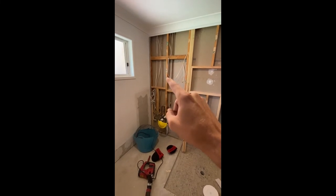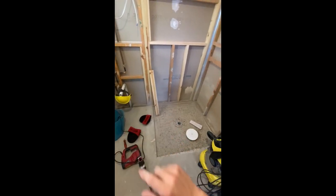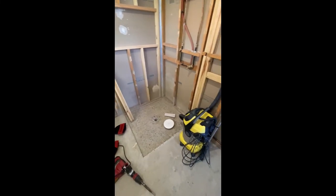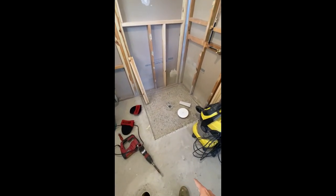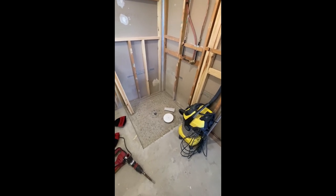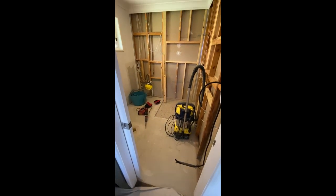There's going to be a mirror with LEDs in it so there's a cable there. We're going to waterproof the whole area and up the walls — probably around two to three hundred millimetres. That's sort of it, guys — I'll hopefully have more structured videos and progress videos going forward. This one is just to get it stripped down with the rough-ins done, and then I'll show you the build process. A lot of people tile over tiles but I'd rather strip it back and start from scratch — more work but a better result, and that way you can get rid of that step/lip for a seamless transition from carpet to tile to shower floor. Give us a like and let us know what you think — have a good one!